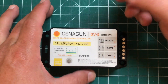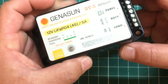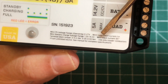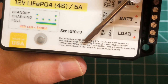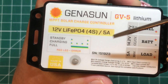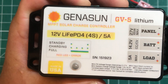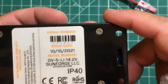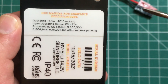There's not much really to fuss with — this is very simple. Everything that's important from the manual is written on the unit itself: your max voltage, your max input short circuit, your max input current, terminal block torque three to five inch pounds. You've got some different charging states listed, and red LED equals error — so when you're out in the field without the manual, you can still know what you're doing. And it's made in the USA, which is awesome. On the back, this unit was manufactured October 15th, 2021, and you've got your serial number and some other information.